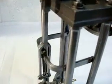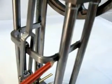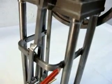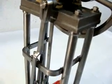I did actually find in the kit that the steel supplied for this stirrup-shaped connecting rod was actually too narrow, and I had to supply a wider piece of steel to enable that to be machined out correctly. I also found that this support arm, which is supported by four slots in each of these columns, had been drawn wrongly. The slots were found to be, as drawn, one-sixteenth of an inch, but in reality the support arm when it's made is much narrower than that. Therefore I had to reduce the depth of these slots to a thirty-second of an inch to enable that to fit correctly between those columns.